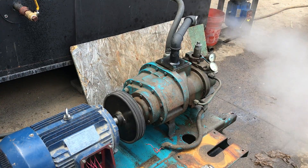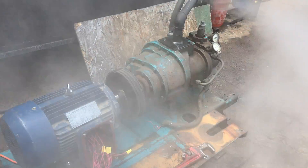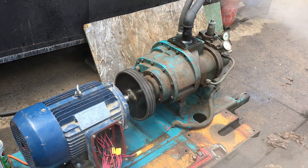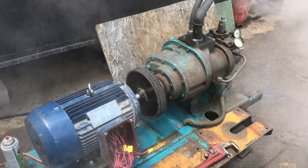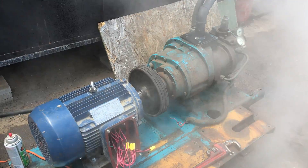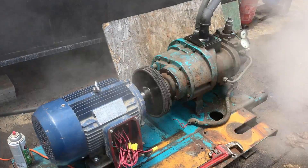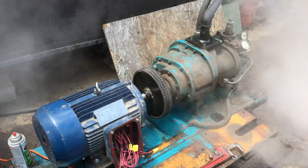Let's go back outside. Wet pallet wood — we've had a lot of rain here lately and all our wood supply is wet, but I'm really quite happy with it. We'll give another video on a higher performance day. We've got this thing stoked up and fired to the max. I think we'll be able to get a good 10 kilowatts out of it with no trouble continuously. For a 10-hour day that'll give us 100 kilowatts — that's about half our capacity here. So we're going to be able to generate about 50% of our capacity for the shop.